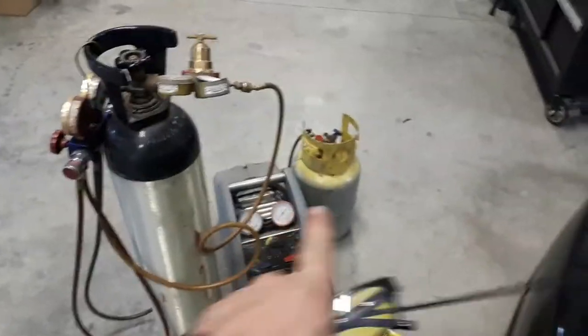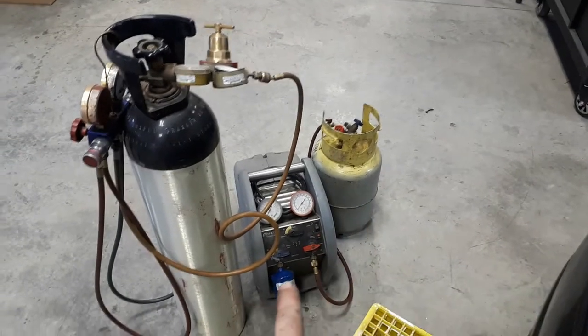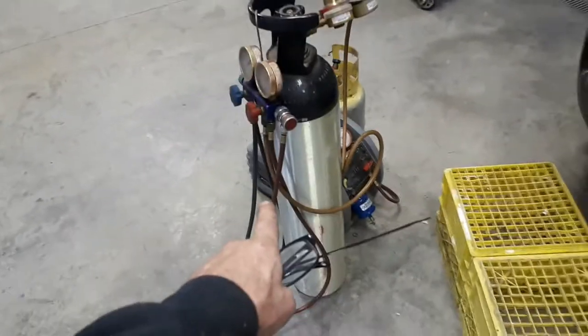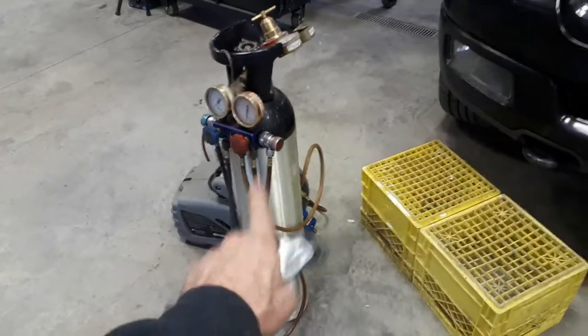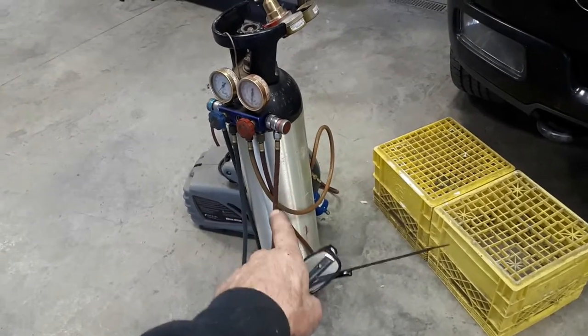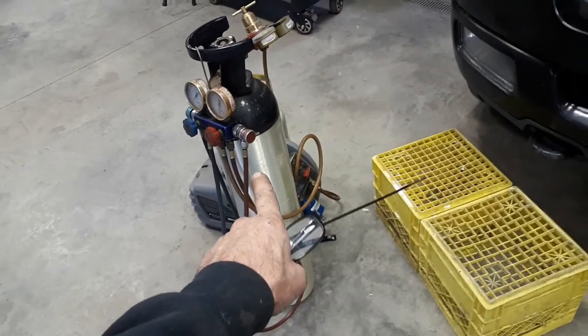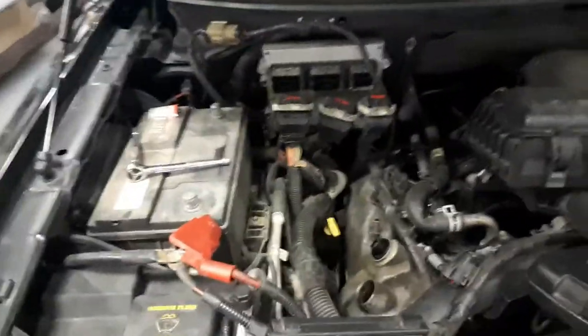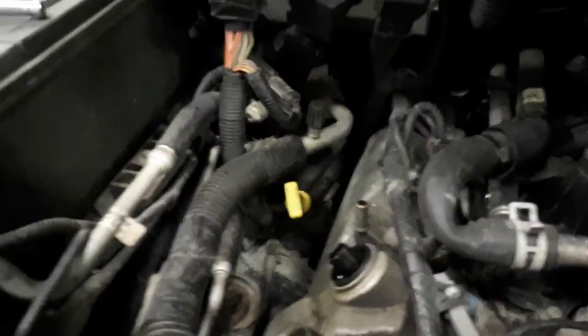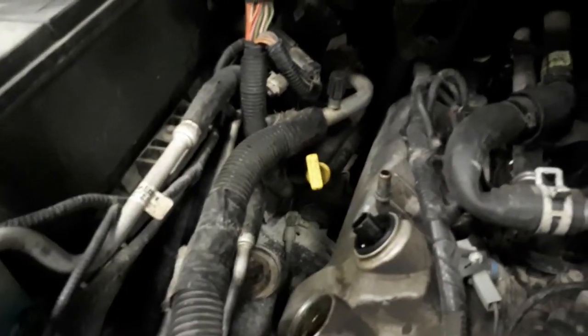I finished removing my refrigerant and now the refrigerant is stored in the tank using my reclaiming machine. I brought that into vacuum - you have to bring it to around 15 inches of vacuum to make sure you have all the refrigerant out. Then I brought my pressure back up above zero with nitrogen to prevent the system from inhaling any moist air when I go to disconnect my refrigerant line.